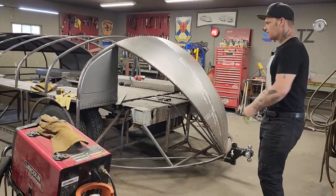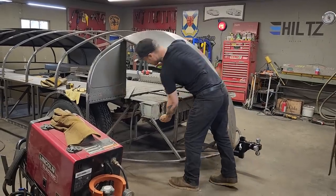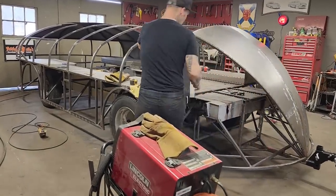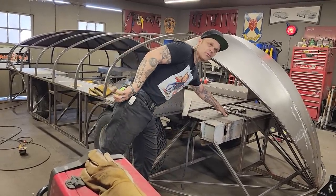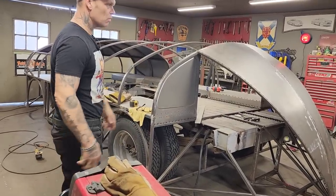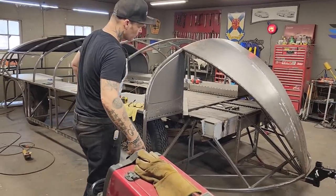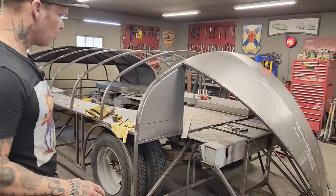And what's going on, it's a unibody truck. All the frame is unibody, it's spot welded to the floor. There's no end of the frame to shove anything in or bolt anything on. Everything is spot welded together. And if they can spot weld their floor on the frame, that means I can spot weld a mount on the frame. That's how you know what you can do, from things that you take apart or things that you see that other companies or other vehicles do, and then you know you're allowed to do it. So I really feel like that trailer hitch would not go anywhere.